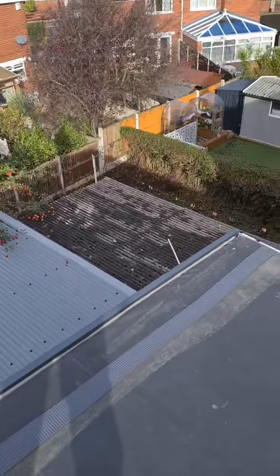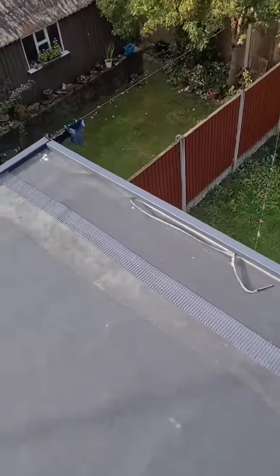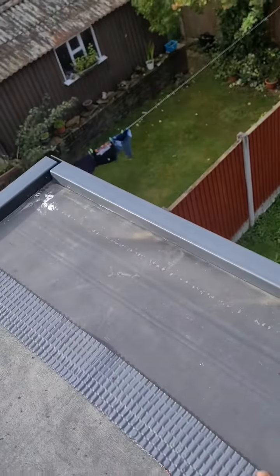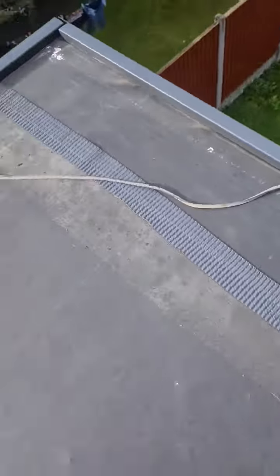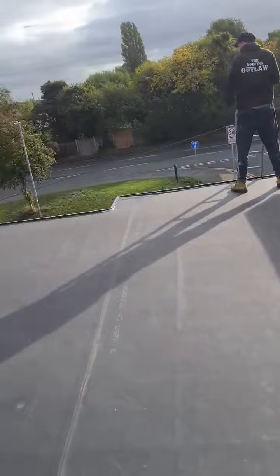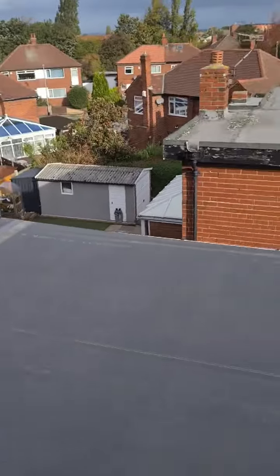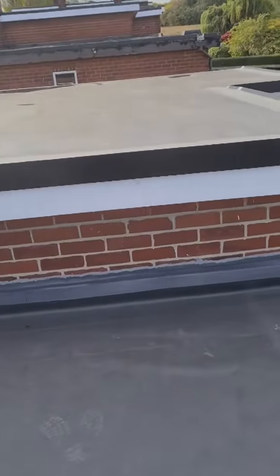It will appear you wasted your money having this roof put down. I might speak to the roofer that did it, but it's not going to come and deal with this, because this is absolutely rubbish. This silicone here — it's silicone, the roof is oil-based, the two don't stick. Really bad job. Unfortunately it needs the full perimeter dealing with. I will cut a price for that for you.